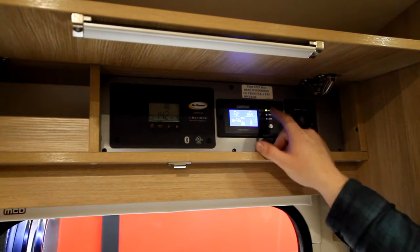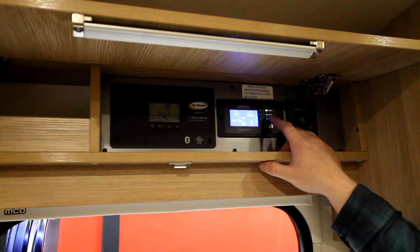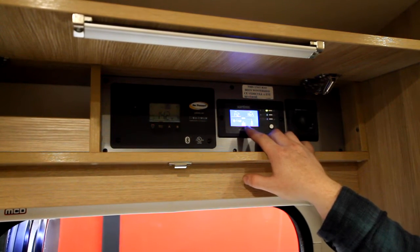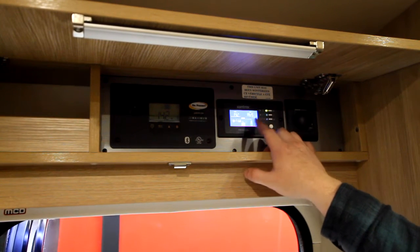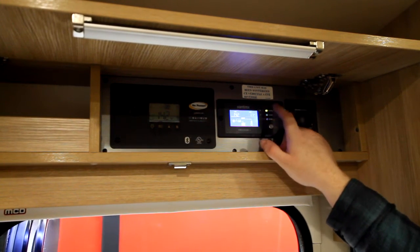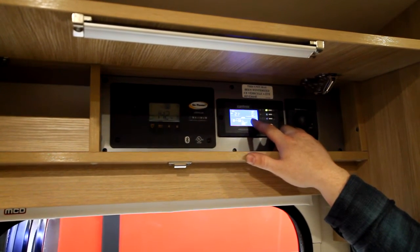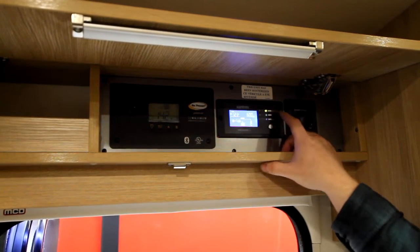Next to that, you have your Freedom X controller — you can also see your battery voltage here. You can see that the battery type is AGM. Right now it says bypass because we're taking 120 volts and charging our batteries through the inverter. If we unplug, you'll see just the battery to little light bulb showing that it is inverting 12 volts into 120 volts. If you hit the little chevron up button here, that's going to show you how many amps we are pulling in. Right now we're charging at 10 amps. We can see our AC input is 2 amps with zero load because I'm not running a microwave or air conditioner. We're getting 123 volts at 60 hertz.